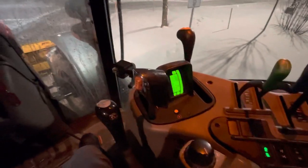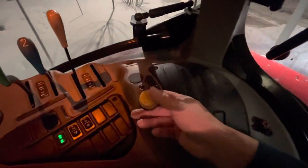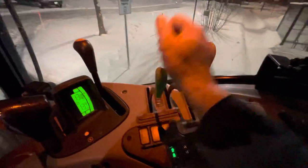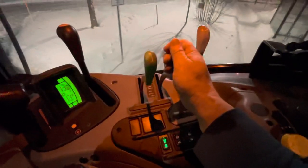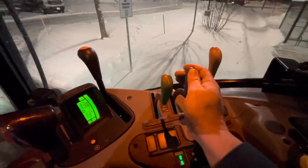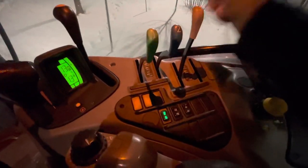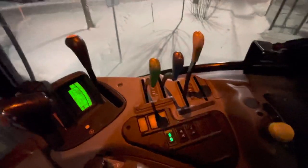Of course I've never tried going into 16th gear when parked before. Up here I have the PTO, so I turn my PTO on for my blower. Then these are my remotes for my blower — to swing my chute around, and my up and down on my chute, and my deflector. If you were going to run different remotes, you can actually move this to another setting and that gives you different remotes on there.